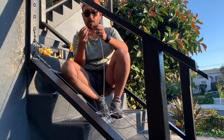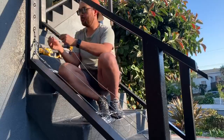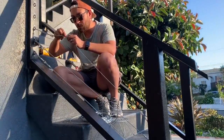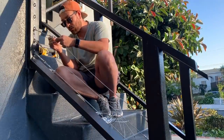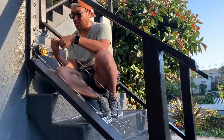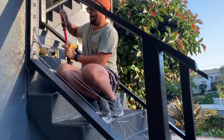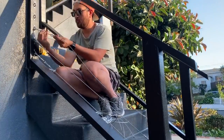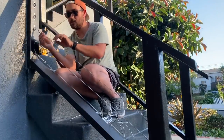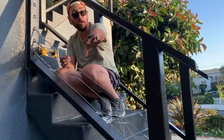Same process: run your crimp through, run it through your turnbuckle, and right through your crimp. Be really careful when you're threading this, because you can stab yourself in the fingers with all the braided cables — I cussed a lot doing this. Pull it tight again. I'm at the unfortunate spot where I actually didn't pull enough of this cable out. It's okay, we're learning together. Please keep watching.